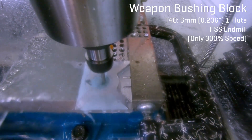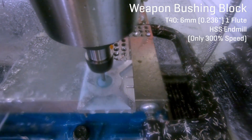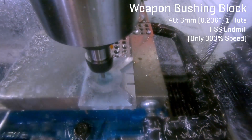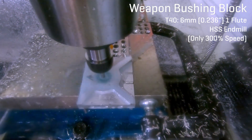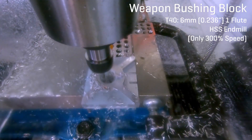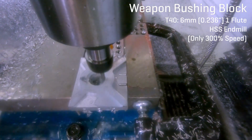I ordered all of my stock from Xometry supply, which meant everything was saw cut, and I made sure to get it all cut within an eighth inch of the final size that I needed, so I'd be able to do every operation for a given size of one part, and then swap in the next piece of stock, rinse, and repeat. This greatly reduced the setup time, which is one of the major time sinks in CNC machining, driving up the labor costs associated with it.